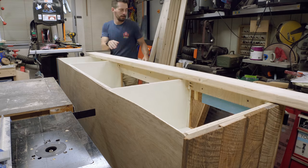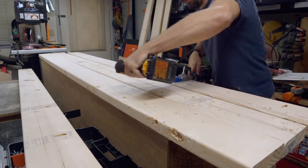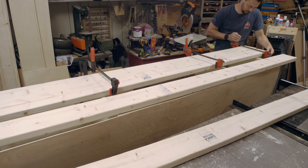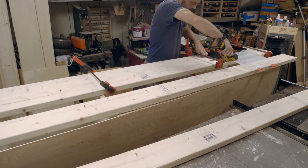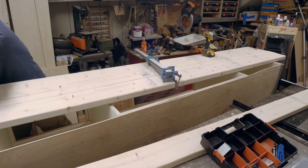The last thing to add was a tabletop, and I did it in the simplest way possible. I laid out some 2x6s and pocket screwed them from the backside to make a panel. In the long run, there's potential for this to warp or bow a little, but it's probably not a huge concern. If you need a more stable tabletop, using breadboards on the ends might be a better approach. It's surprisingly tough to find a really nice straight 2x6 at the big box stores — it took me a while to find four, and they're not even perfect. I flipped them around to hide the knots, get the best face forward, laid them out, added glue between them, and put pocket screws in to drive them together. Clamps are really important here to make sure the faces connect and the ends stay in position while you screw it all together.